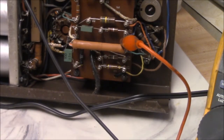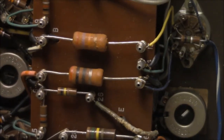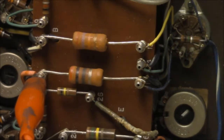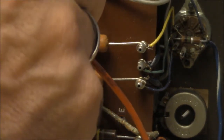The other thing I noticed here, too, is this doesn't show up on the camera terribly well, but this resistor is a little dark, and I believe that's one of the plate resistors. Yeah, it's got 400 volts on it. I don't know, it's got some issues. One of the other issues